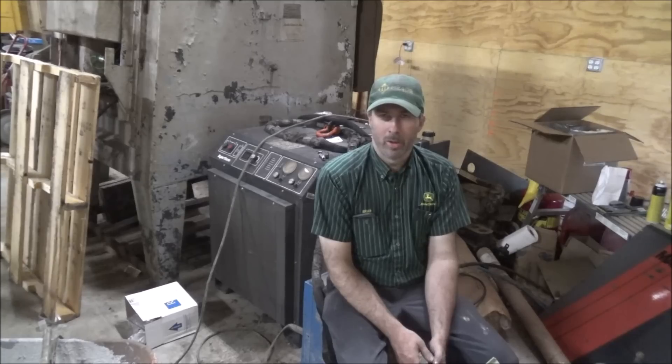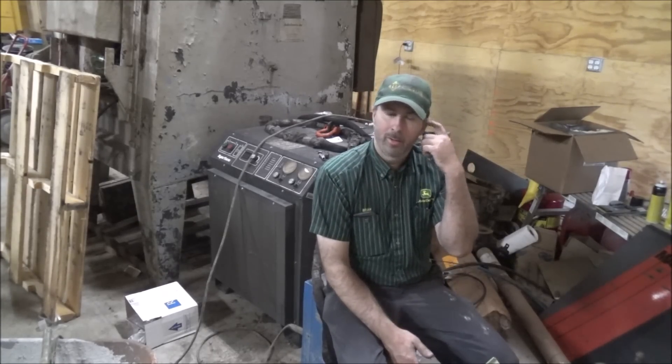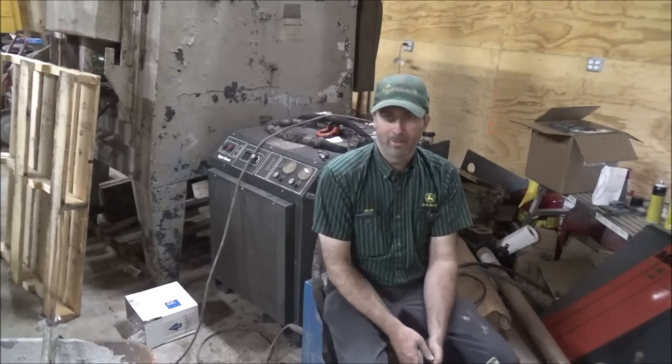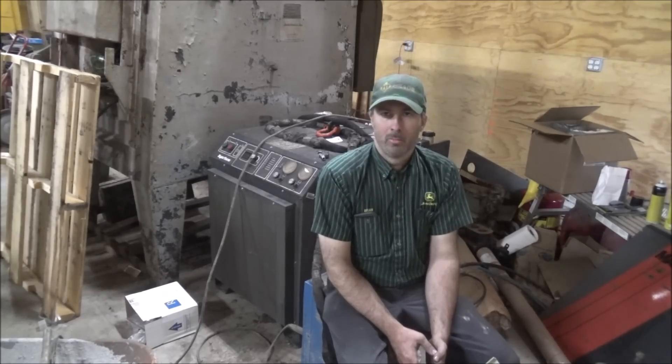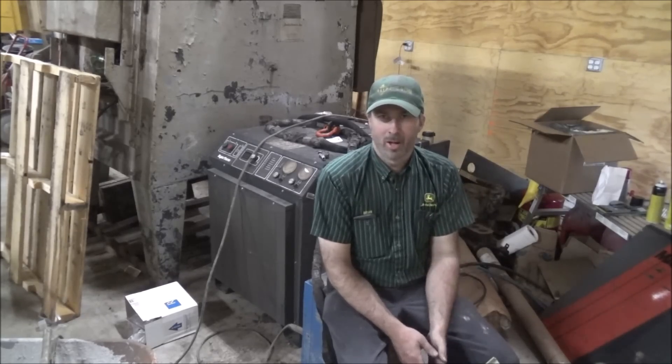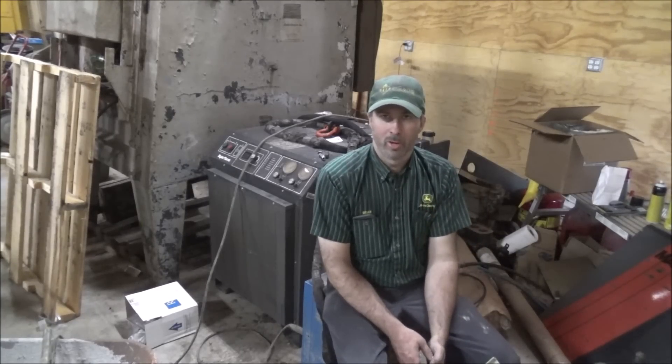It turns out I needed one of them anyway because when I tried to adjust the pressure up and down it wouldn't change. So I've replaced that and got it fixed. Got the air hoses all run on the back — they apparently had this run on separate gases for the shield and the plasma itself previously and weren't even using that regulator. But I'm running on compressed air so I've switched that all back and got the hoses on there.